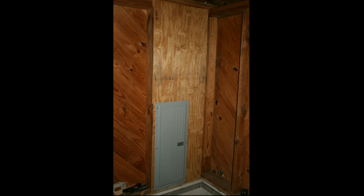Last but not least, part of your codes is going to require that if you have exposed wire - i.e. romex in the wall, which I did as you saw in one of the previous slides - that it is covered up. That's what that piece of plywood between the two studs is serving as: the wall covering. That'll get you past codes, and you just want to make sure that it runs from floor to ceiling so that you have no exposed romex. If you have any questions, just leave a comment and I'll try to clarify anything I might have left out or wasn't clear about. Thanks.